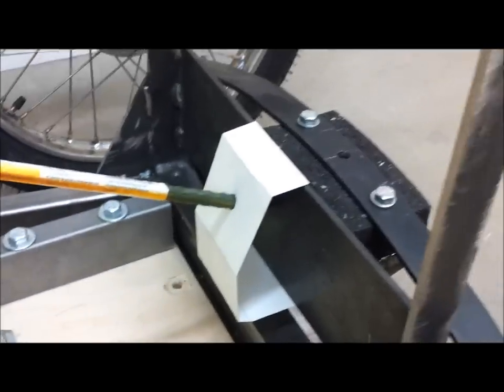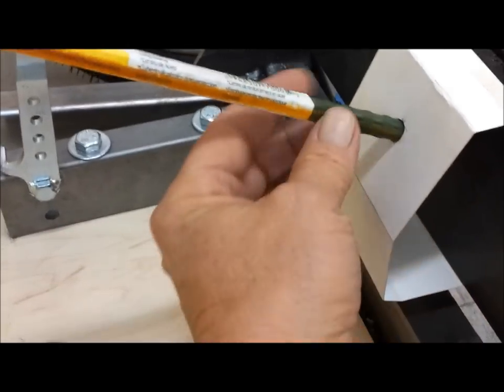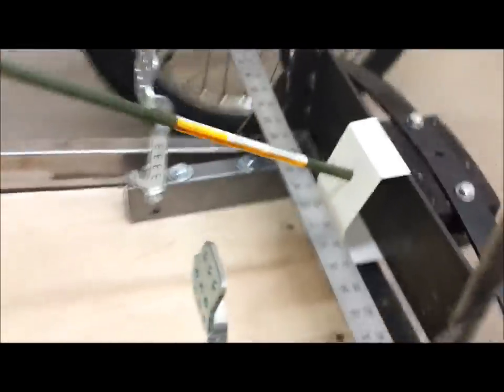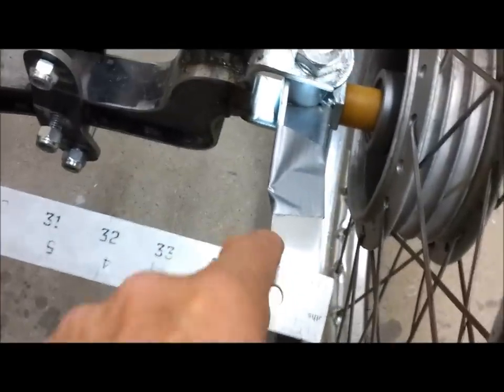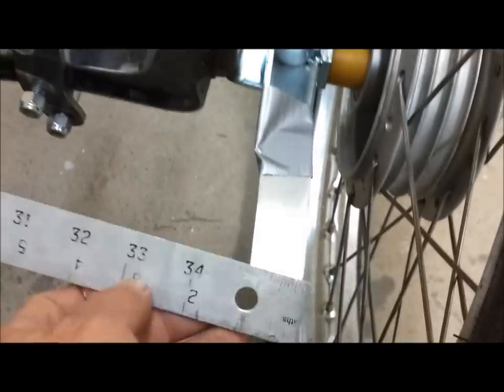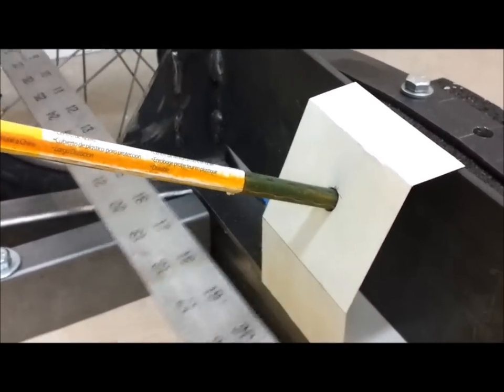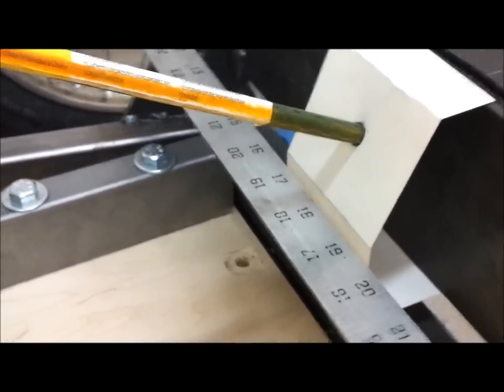Now I have to fine-tune this bracket and this bracket and get them made out of steel. So I'm moving along. And the pitman arms, they'll be right about here. So I used some little pieces of aluminum to extend the spindle on both sides so that I can ultimately get this dialed in, because the pitman arms will hang down and then the heim joints will be right here, and you want that all on the same plane. So I'll be able to fine tune that.